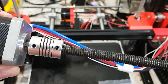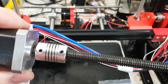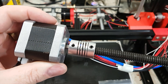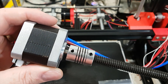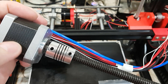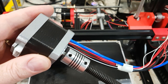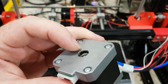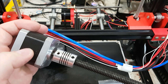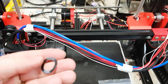You can see there's quite a big gap there — what I've done is pre-tensioned it by pulling it down. That pulls the motor and the screw together and gets rid of the downward springiness, which is excellent. That does leave one last place for springiness, which wasn't very noticeable on this printer but was definitely noticeable on my NEMA 28 printer: the motor itself has spring in it. Some motors have a lot and some don't — there's actually a spring washer on the back which holds the motor roughly in the center, and when you have force going down, that springiness allows the axis to move up and down.